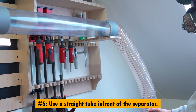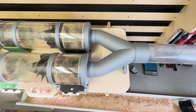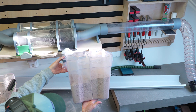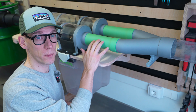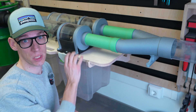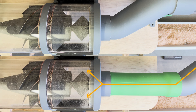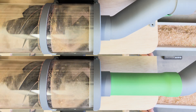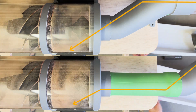By adding a straight piece of pipe I aimed to reduce the impact of the bend. This adjustment smoothed out the dust flow and provided some improvement, though it still resulted in varying outcomes during testing. I also tested adding a straight piece of tube between the white piece and the inlet of the first stage. In tests with high feed rates, the dust is forced outwards to a single spot, causing the first stage to clog quickly. I would prefer the dust distributed more evenly across the first cone and the impeller shroud. Unfortunately the improvement was not really noticeable, as the dust was still forced to the outside of the tube, hitting the shroud at the same spot.